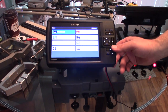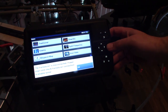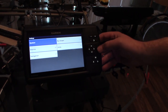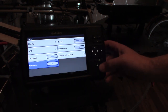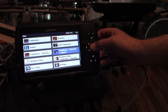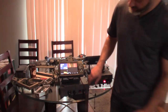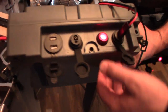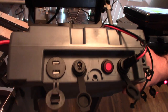We'll put this in split frequency mode for demonstration — go into simulation mode and turn that on. You can get this standard sonar screen back up once you turn the GLS 10 on. This SAE power socket here will be controlled by the switch, so there's power to the GLS 10 only when the switch is on. When the switch is off, the GLS 10 will have no power. Essentially you'll have two power outlets for your dedicated Garmin LiveScope setup.